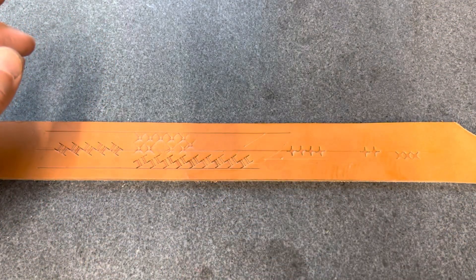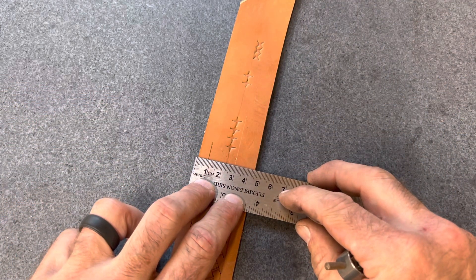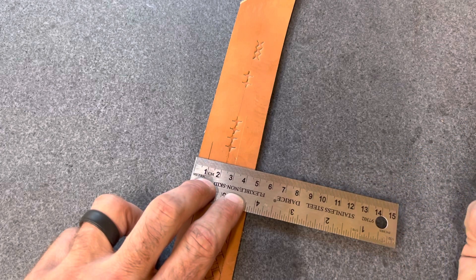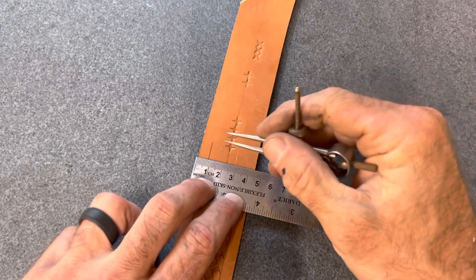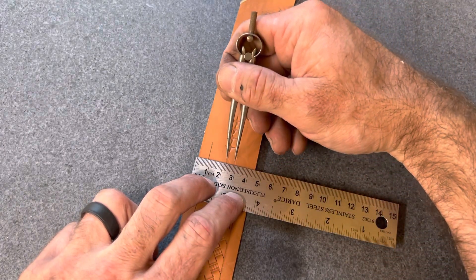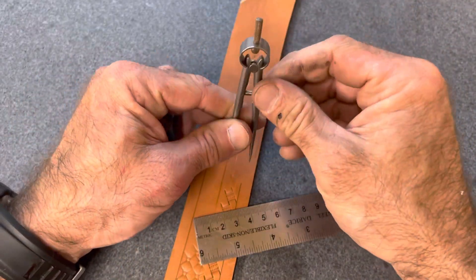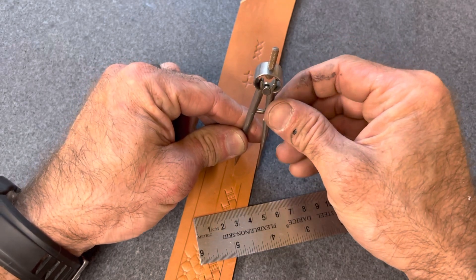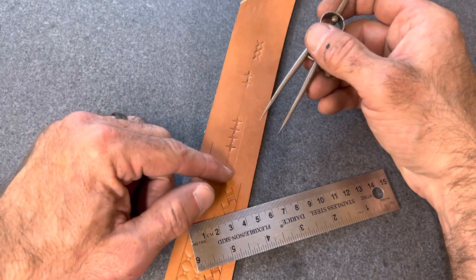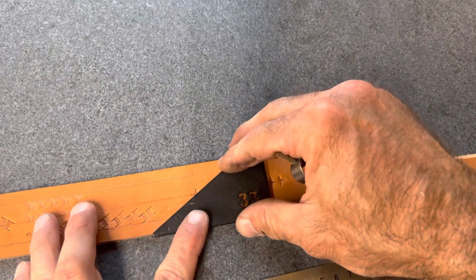So once you're here, you can figure out how wide your strap is. I'm using metric for this because once your fractions get small enough, it gets pretty inconvenient to calculate. So we're 44 millimeters here — that means 22 to center — which means we need to offset that center by five and a half. So we can set this here at 22, leave a dot, come back, readjust our dividers, find the dot, scribe a line. This line we'll use as our baseline to get the ropes in the center of this strap.